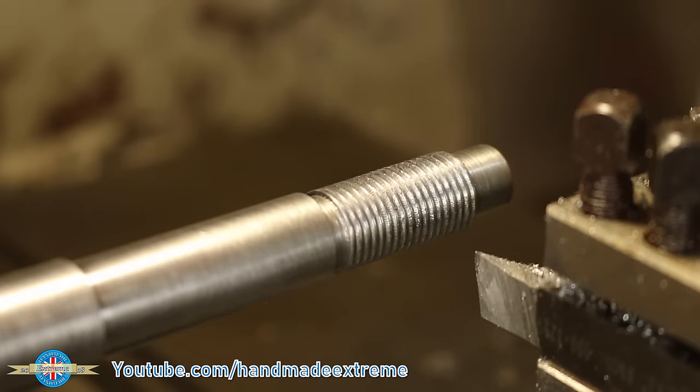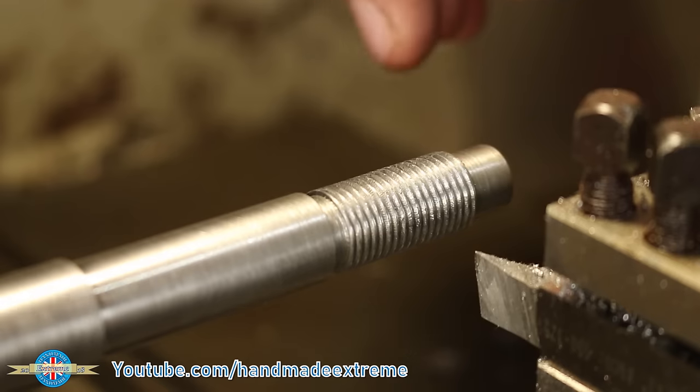Because we're using this method with disengaging and engaging the half nut I've got more flexibility. Using the really basic method where you drive the machine backwards and forwards you can't do this because you'll lose your position. But with this method I can come in with a normal cutting tool, sort out the gutter, go back, put my threading tool back in, and with reasonable confidence the threading tool should pick up and refine the thread.